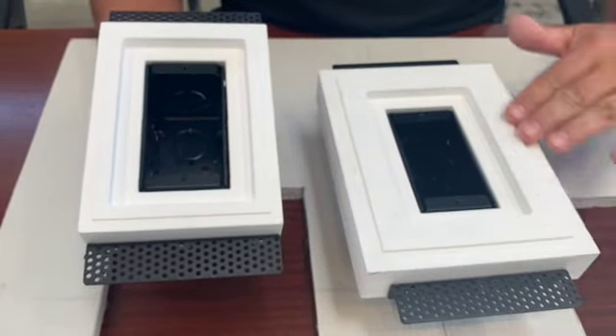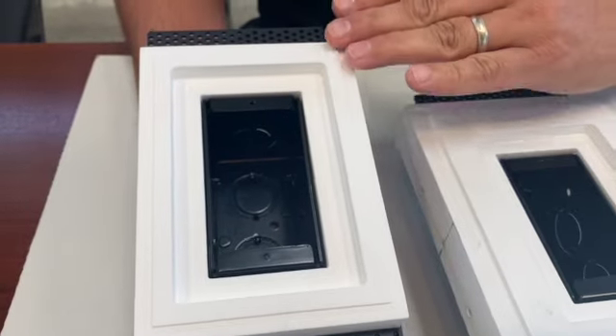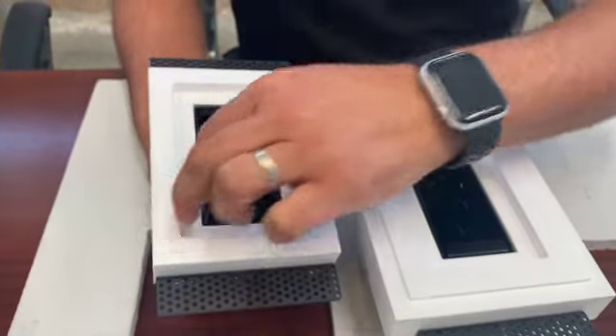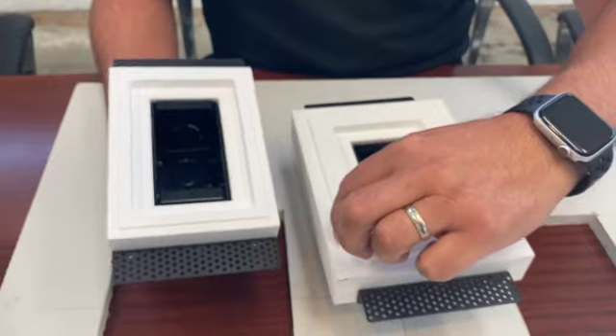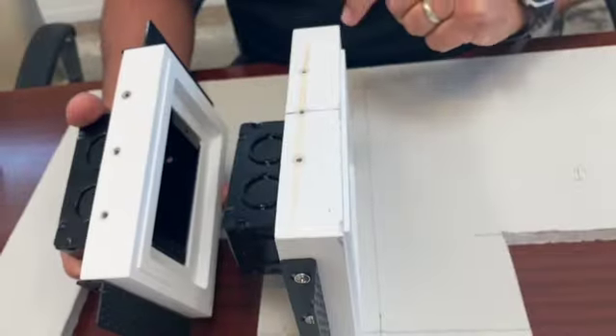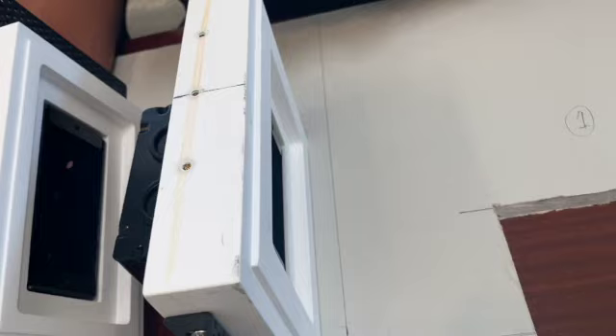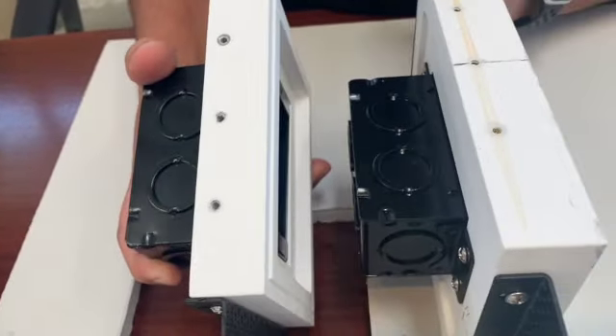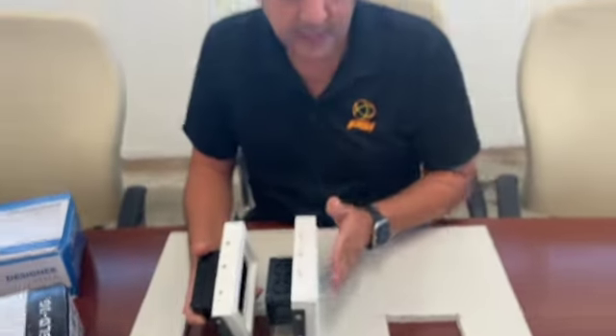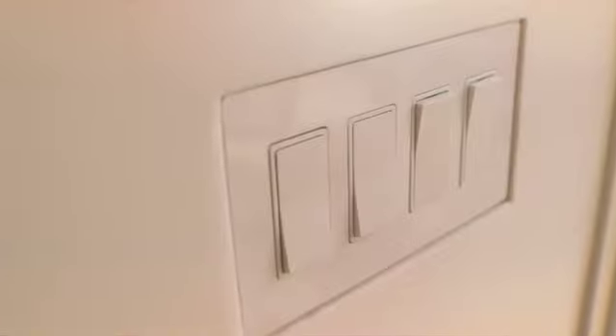We've made the device bigger to allow more space to tape and mud. In the past, mud was getting on the inside, and if it's not cleaned right away when it dries it can harm the corners. We've allowed more space for that. We've also added additional thickness on the sides for the finish surface, since there were instances where people wanted to do an additional layer of plaster or similar finish, so this gives a lot more room. Thank you for watching these instructional videos — we're available at any time via phone or email. Let us know any questions or feedback; we're always open to suggestions.